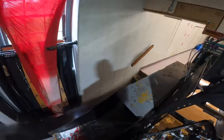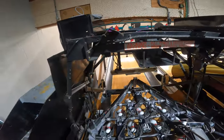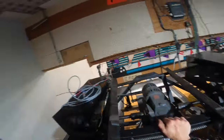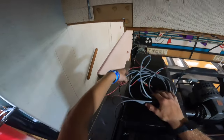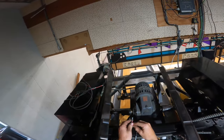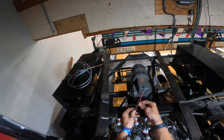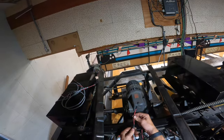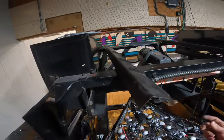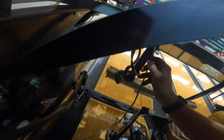We're going to keep these two nuts on the table motor stand. Now with both raceways open, any wires that you're putting into the p-box — you're going to want to put electrical tape on the top of the terminal and where your wire cover is broken to expose your two wires, because you don't want this to short out any other wires in your p-box. We're going to take our taped end going into the p-box and run it up through the front, routing it through the same harness as the old KL plug for the table.